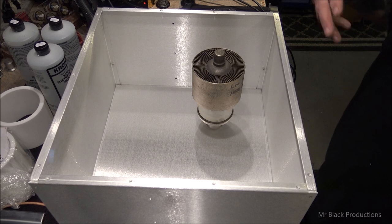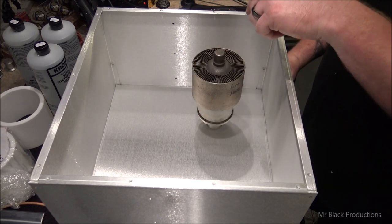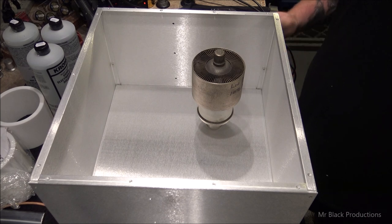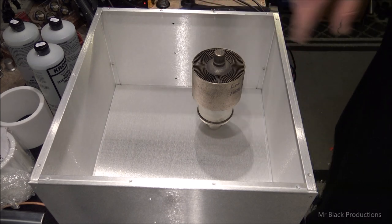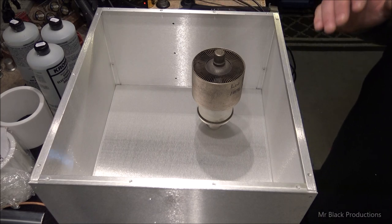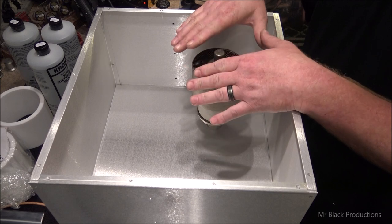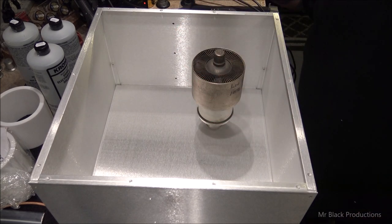And then I went to put the 6 in there, and the anode on the 6, which is 1 inch and some schmoo bigger all the way around, it was too close to the edge of the cabinet and I was having arcing issues. And I tried to put Teflon on there and it still would arc over. So what we have to think about. This is going to be our rough location of the tube.